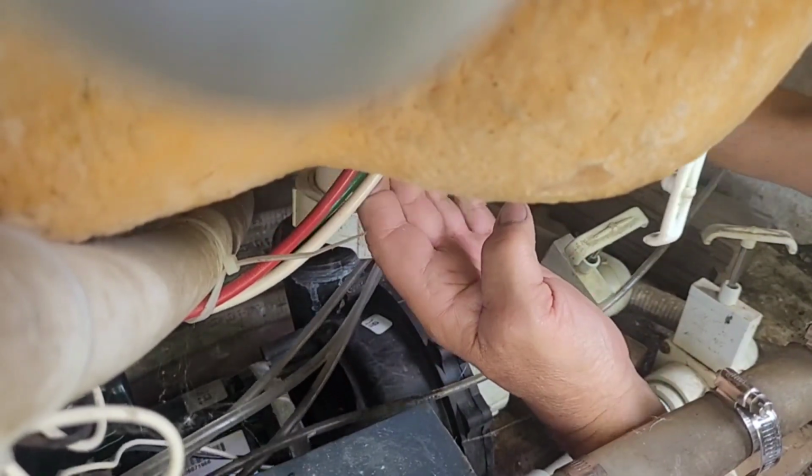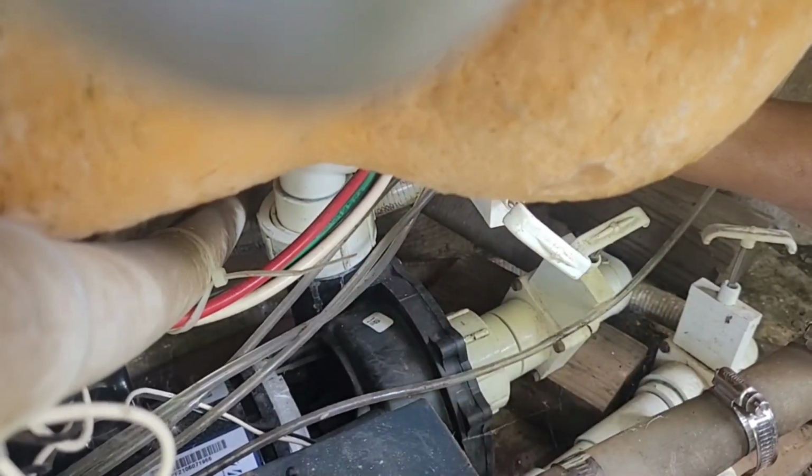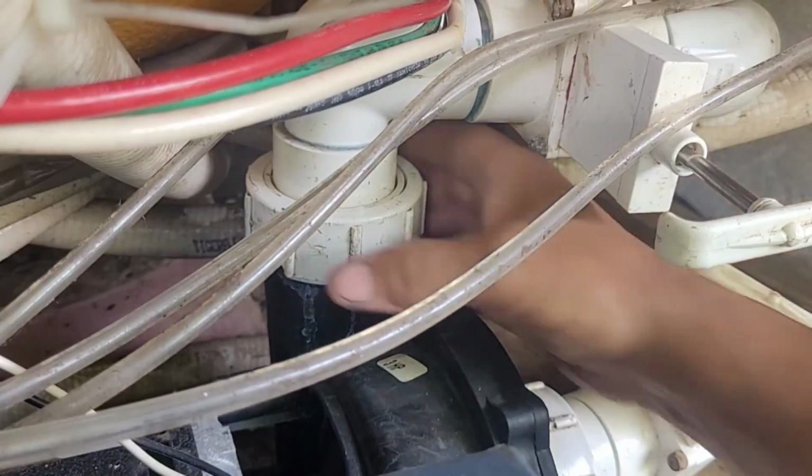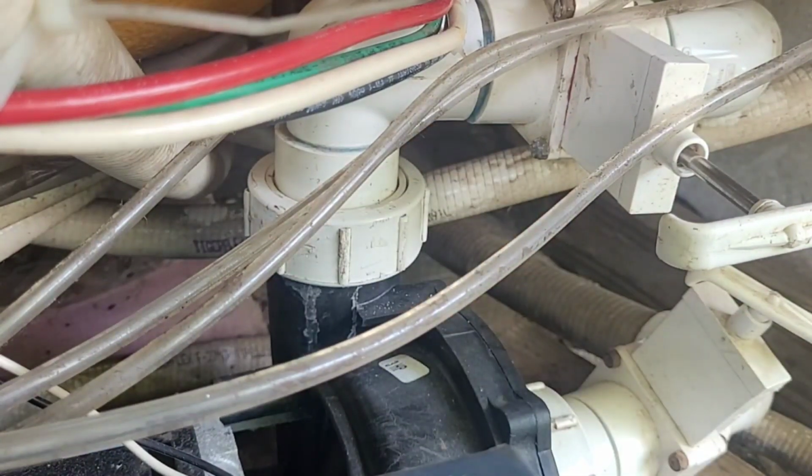So what I do is get the O-ring up in there good, because it fits that groove. Pull the flange down over it. Hopefully it tries to stay in place till I can get my fitting over to it. And if you get it on there square, we should have success, hopefully. Yeah, it took a little finagling, but I think it's on there square now. I got it good and hand tight, but you really don't want to overtighten these.